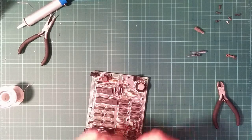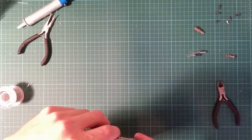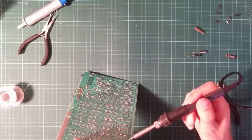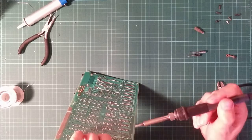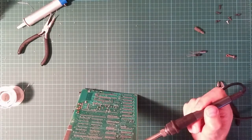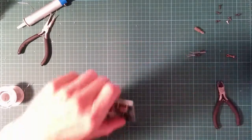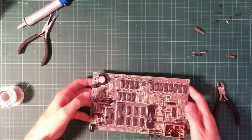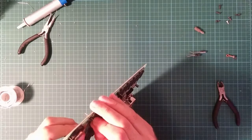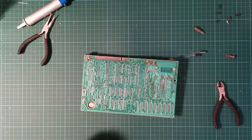Have better luck with. So I've got one spare hole there, so I don't actually need to clear the one in the big track, but I do need to clear this one next to it. I wonder if I can use the push through trick for that. So what I do is I apply a bit of force to one side of the hole against the solder plug in the hole, melt it from the other side, and in it goes. I want this to go through quite a long way. That will do. And that's standing well proud of the board. So all we do is just bend it over. But I'd like to go in a bit further than that. Yeah, like so. So that just comes down. Done. So now I can solder the joints on this side and it's finished.